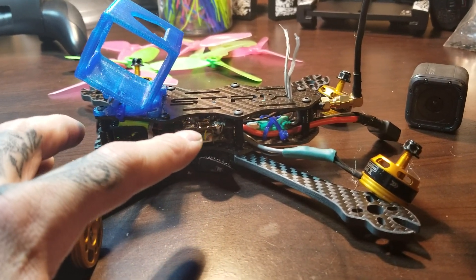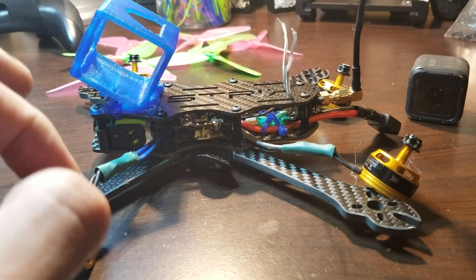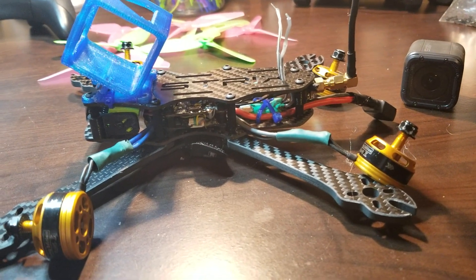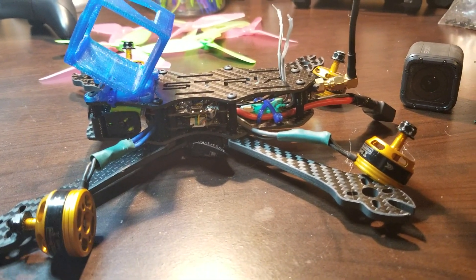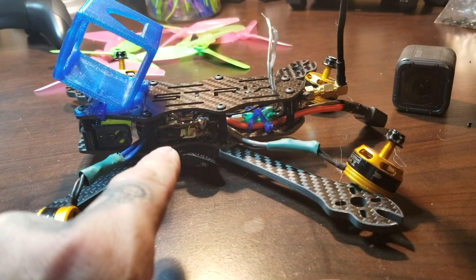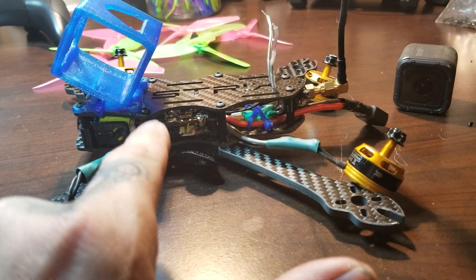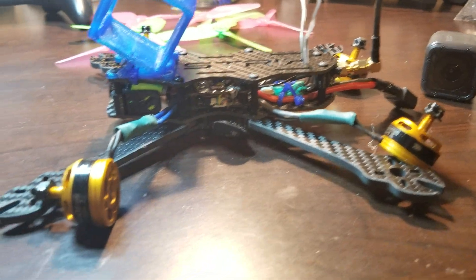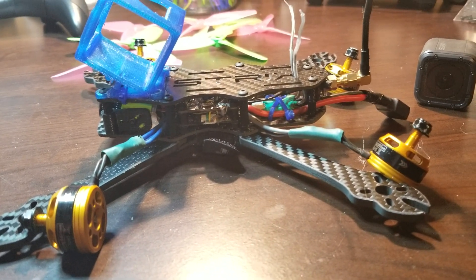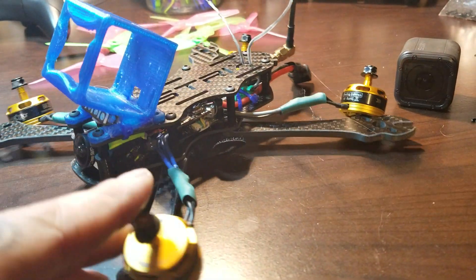Either way, I did a small soft mount. One of my favorite little things in all my parts is the little rubber isolators that tiny whoops have on the corners of their board when you screw it down — to stop vibration from screwing up the flight controller. You cut one of those in half and it fits. It already had soft mounting on the bottom from the ESC board, but I doubled it — did it there and there. Hopefully it will eliminate any of the vibration. This frame is solid so it shouldn't wiggle.